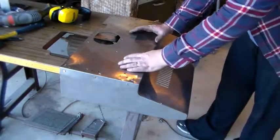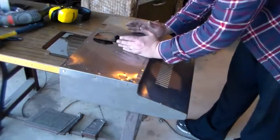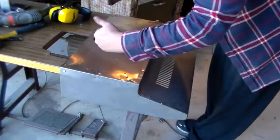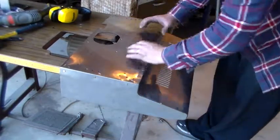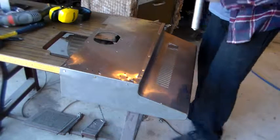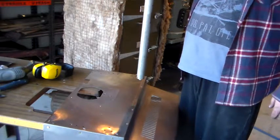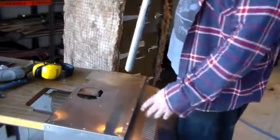The rest of it's going to go together with a piece along here that will slide and hold the mould together. The rest of the apparatus on the machine will run on tracks backwards and forwards this way, and then another set of tracks backwards and forwards the other way to give me X and Y adjustability. The clamping portion will also adjust backwards and forwards, and the actual injection module will sit about here and adjust up and down on the Z axis, giving me ultimate control in all directions for different shapes and sizes of moulds.